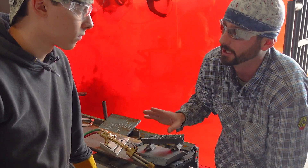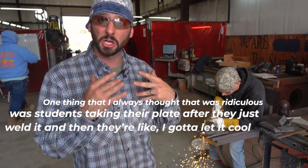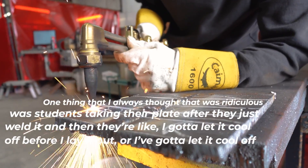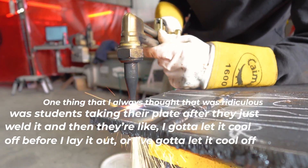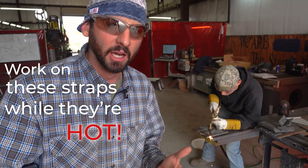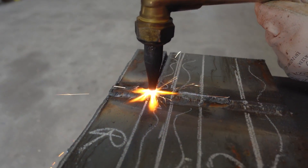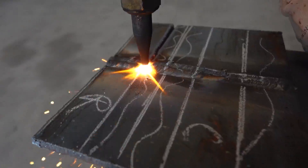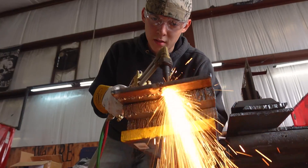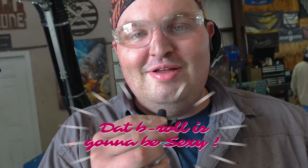Some places will make you actually cut your straps and some places won't — they'll just take it from here and you'll be good. One thing I always thought was ridiculous was students letting their plate cool off before laying it out or taking it over to grind the straps. Work on these straps while they're hot — obviously don't touch them because they're hot, but it's better for the steel to do it that way. Cut on the right side of the line, don't go under that inch and a half.